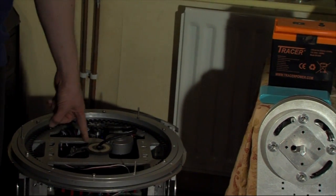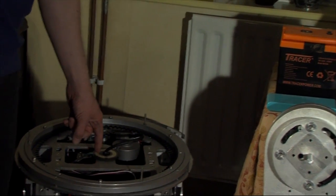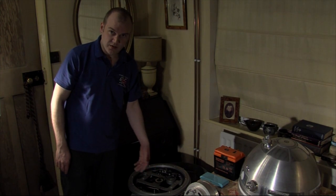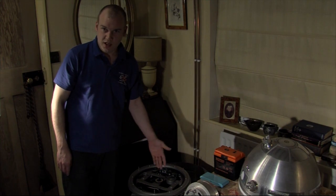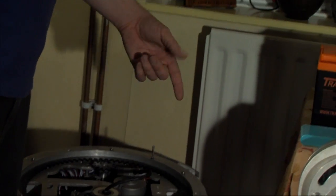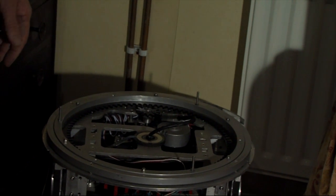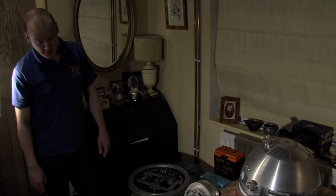On the top here I've got a potentiometer, which allows the position of the dome to be known by the body. So I can tell R2 at any time to face forward, or to do a head shake, or to spin his head — a full turn. Lots of control. It's got a nice little setup really.